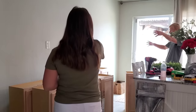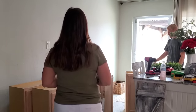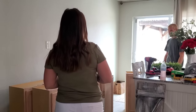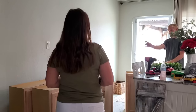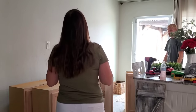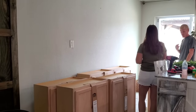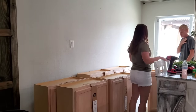At the bottom we'll use the trim I have out there. We're going to have to build like a two-by-four little box — I have the two-by-fours out there — and then just tack it on. Should we do that before we put the cabinets? Deal with the baseboards real quick, because we have the two-by-fours out there. We can just build two small little boxes.